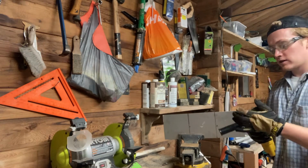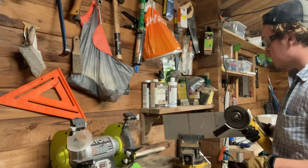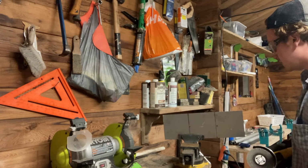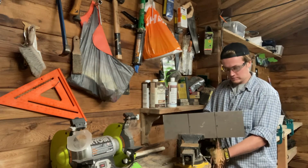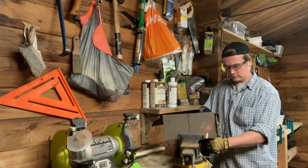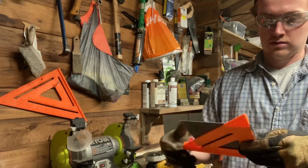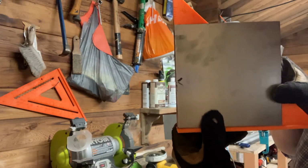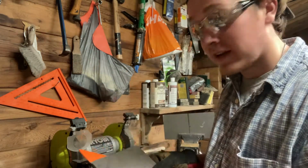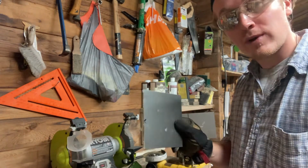And then I take my angle grinder. What would be best would be if you had a table circular saw with a metal band saw to cut something like this. But with practice, you get decent with a handheld circular saw as such. Now that is pretty straight for a handheld cut, if I do say so myself. Now, repeat, you only have one more cut to do if you got the 18-inch metal sheet like I did, and then we're going to start welding.